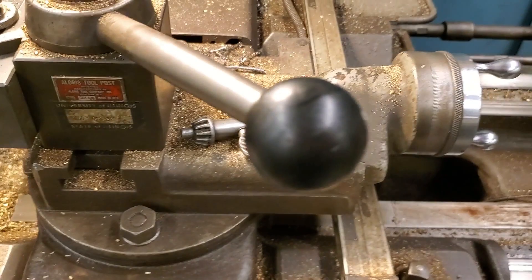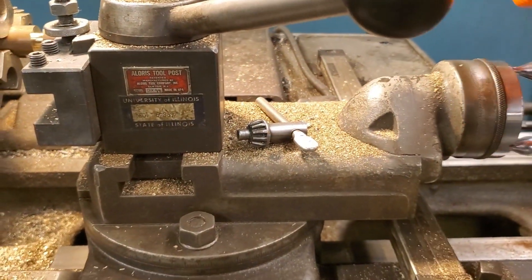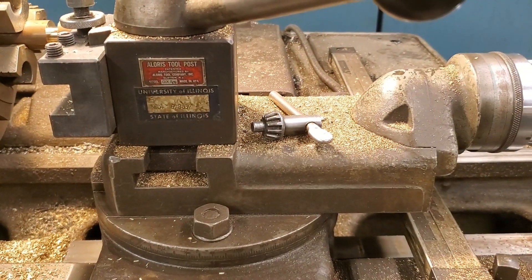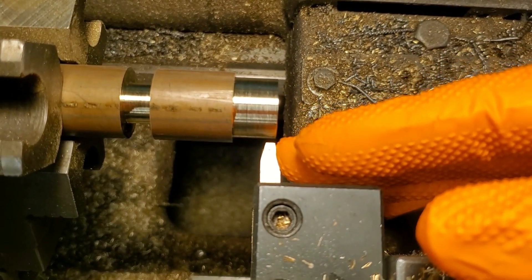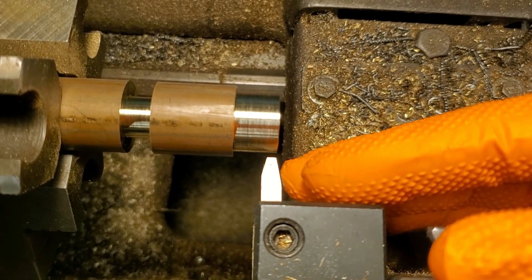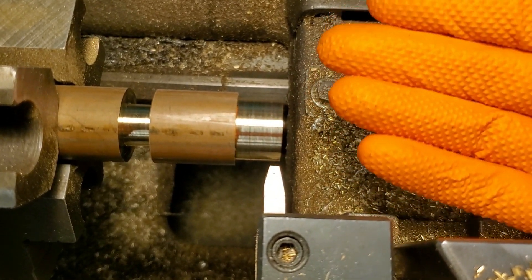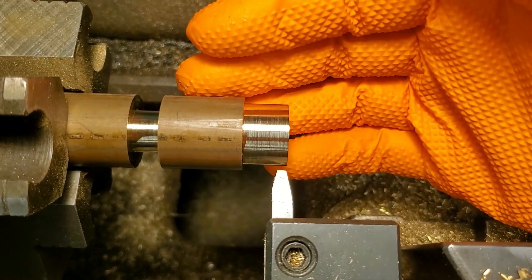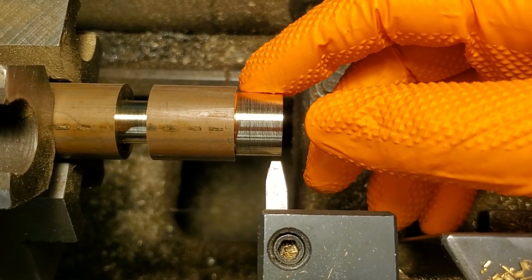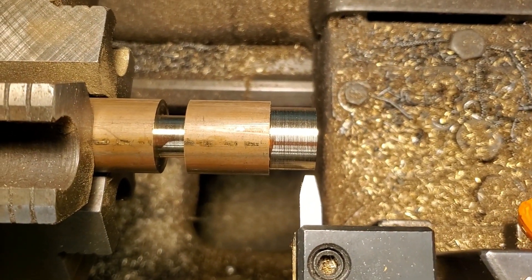To do that I have the compound of the lathe set parallel to the lathe axis. Once I've cut the first thread I'll move over by the pitch of the thread to cut the second one. You can see I've got my threading tool all set up and this has got the correct thread profile, and I know from the first part that I made exactly how far in I need to move. The thread depth is 66 thousandths of an inch, or 132 off the diameter, which is almost all the way to that surface right there. Once I get that cut I'll measure it, make sure that it's right, and then I'll move on and cut the second thread.